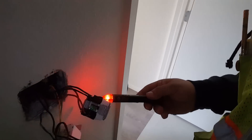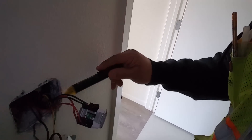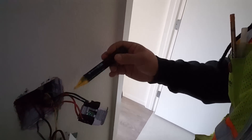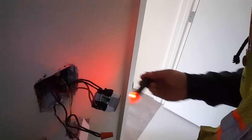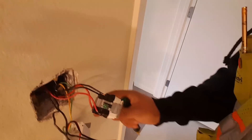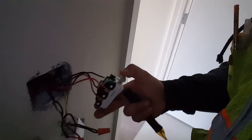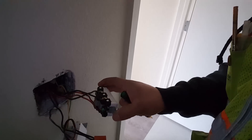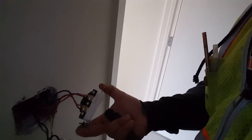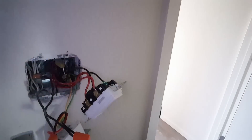One of my blacks here is my line. When I flip the switch, the line goes up and feeds the fan — the fan is wired to the red. When I flip the switch, it turns on my fan and energizes the red, which turns on my light, so both come on at the same time. Two-pole is working now. It's not the most professional-looking way, but it's efficient — it only uses 12-4 wire from here to the light. I still have my neutral in the box per code. Here in San Francisco we have to have a neutral inside the box even if we're not using it.